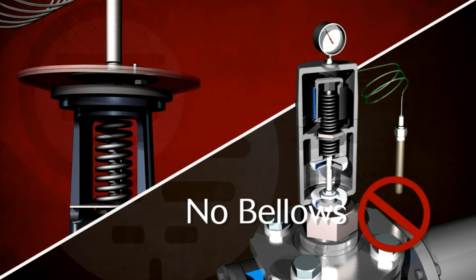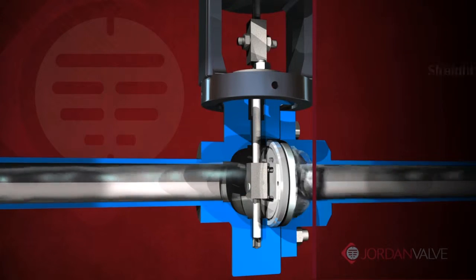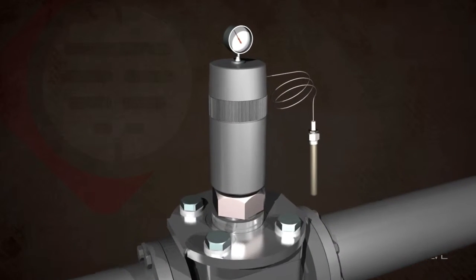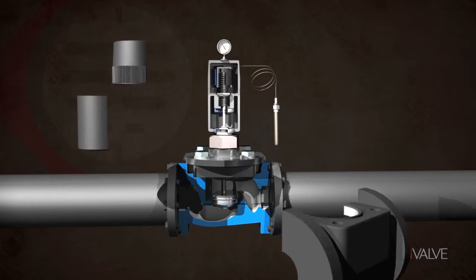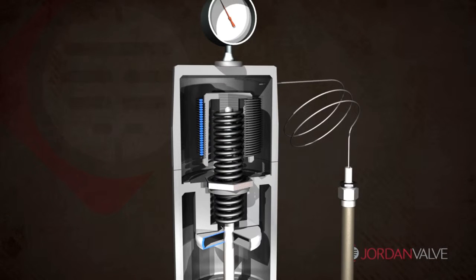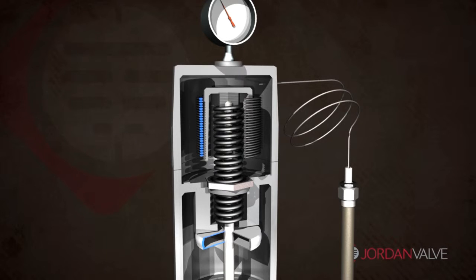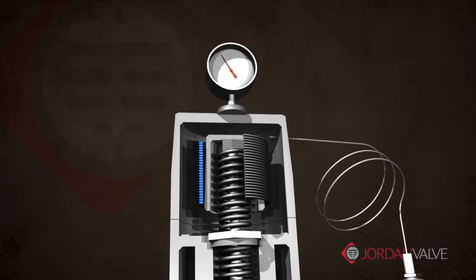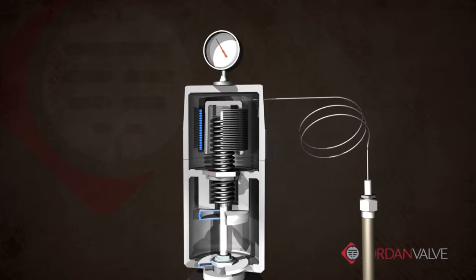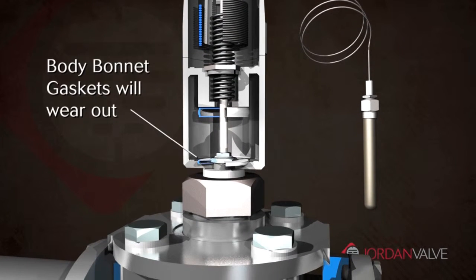With the sealed actuator and stainless steel diaphragm, there are no bellows necessary, which can be associated with sloppy and inaccurate performance. The sliding gate seat design ensures straight-through flow, ease of maintenance, and quiet operation. Other temperature regulators on the market utilize a globe style valve design. The longer stroke associated with globe style valves, coupled with the small surface of a bellows design, often yields inaccurate performance. Over time, repeated valve action will stress the bellows, leading to eventual failure which allows fill to escape.